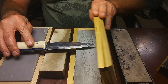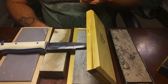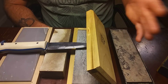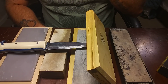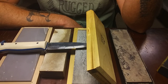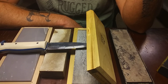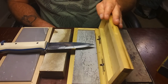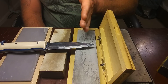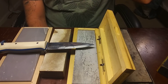It's not necessarily about time, because everybody watching is at a different sharpening level. For instance, with my coarse DMT — the extra coarse is 220 grit and is really just for shaping your edge. Off the coarse DMT at 320 grit, I like my blade to shave or be very very close to shaving. That is one of the secrets to how I get such a sharp edge. If you've already got a shaving sharp edge off your first coarse stone, the rest is just refining — it'll get sharper and sharper the more you go through the stones.